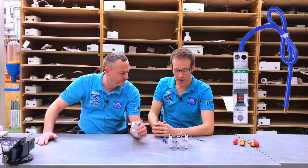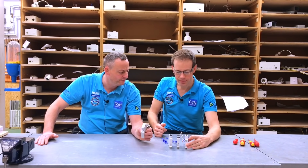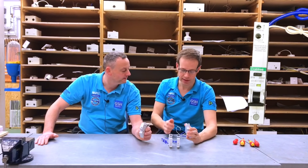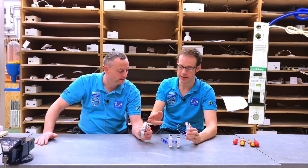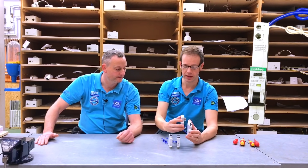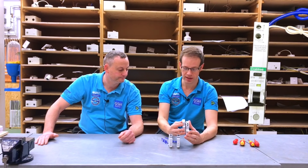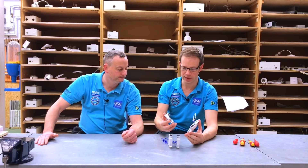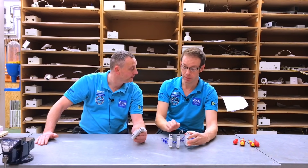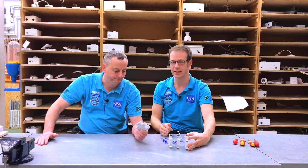Is there an issue with the larger Star RCBOs? The larger Starbreaker is a fantastic product and still does its job, however it's not compatible with this AFDD device — mainly due to physical dimensions. You can clearly see it's not designed to fit next to it; there's no way those will connect to each other. So we need to connect the AFDD onto the Crabtree miniature RCBO, which is a fantastic bit of kit anyway.